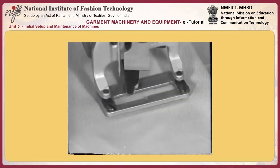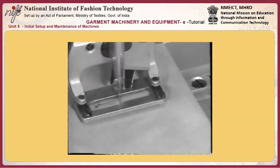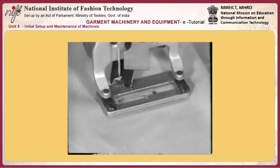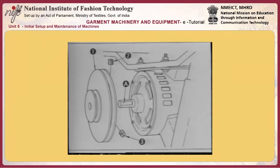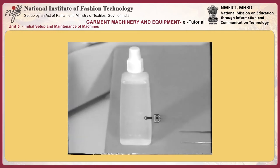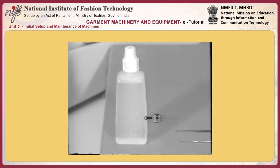15.6. Adjusting whip stitches. To produce neatly finished whip stitches, the bobbin thread tension has to be basically increased. Adjust the bobbin thread tension to approximately 20 to 30 grams. Adjust the needle thread tension using tension controller number 1H. For whip stitching, thread tension is consistent for both bartacking sections and parallel side sections. So, adjust tension controller number 2I so that its tension disc will apply no tension to the thread.